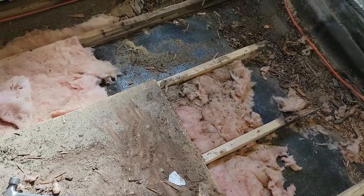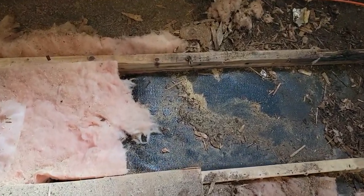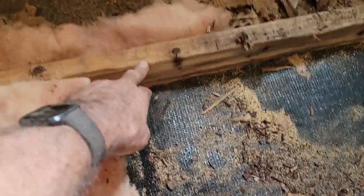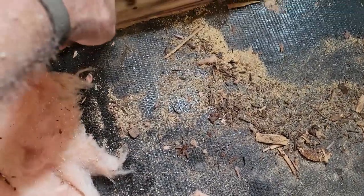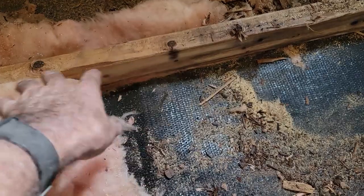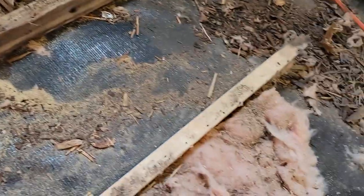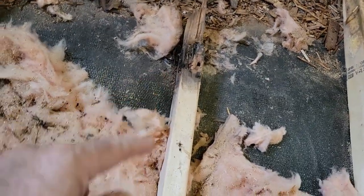I pulled up that next board to see where I need to go, and the next support back is right here. So I need to come back to here for my joint so that both boards are supported. I need to move from about here down to here — at least three inches on both sides so they're both supported good. This one I can do over that seam; this next one, because it's rotten over the seam, I need to bring it back clear to here.